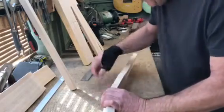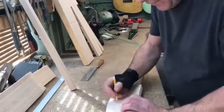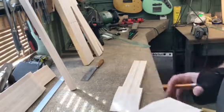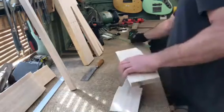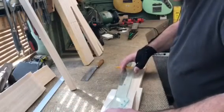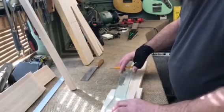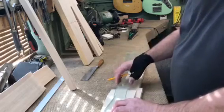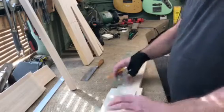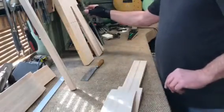So your nut is going to fall. Your nut has to have a flat spot. I actually machine a flat spot in there, so I know exactly where the nut's going to fall. So my nut's going to be there on the ledge. So I got a ledge because I'm going to have a top lock on this model. So then I have a flat spot here for the top lock already in the program.